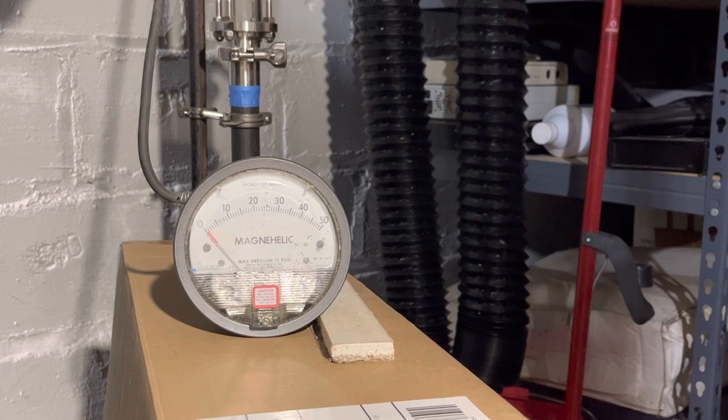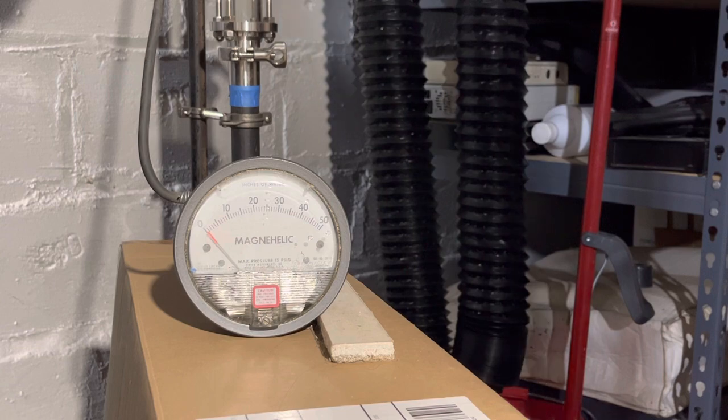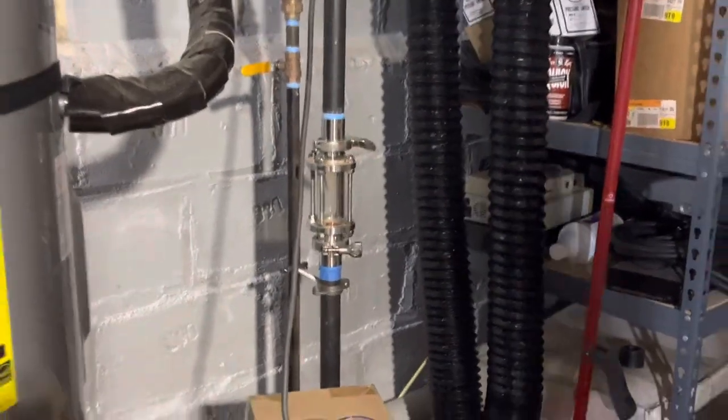So now, it's interesting. I expected us to go to vacuum, but it didn't occur, and I don't know if it's because I have like half of my radiators shut off or what exactly. But normally in my normal call for heat, I will go to a vacuum at least for a little while, a couple minutes, but that's it. We're at zero.